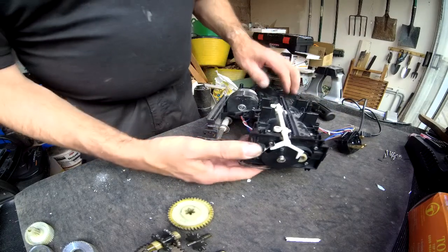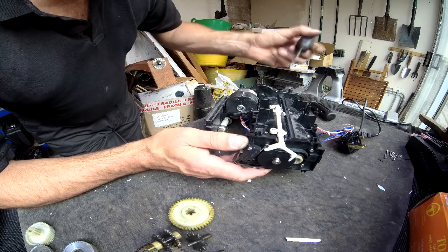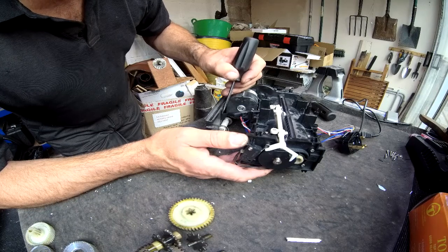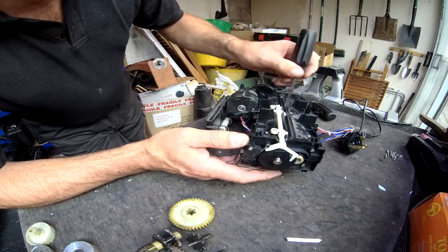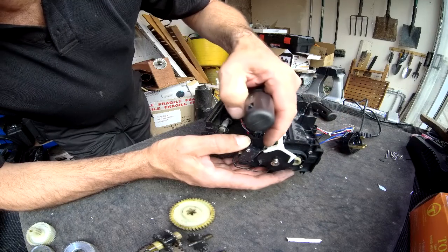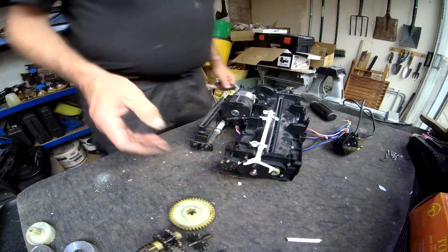Now, that will be the stop position. So when you put a sheet of paper in there, or a CD or credit card or whatever in here for shredding, that lifts that, makes the switch, which starts the motor, drives all the gear in, and then when the paper has gone through, or the CD has gone through, that will continue to turn, because that will be like so, and the switch is engaged. Then that will turn like so, and when it gets to there, it allows the switch to open and switch the motor off. Very simple.